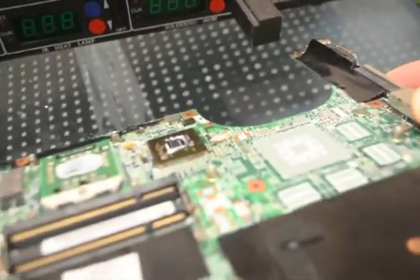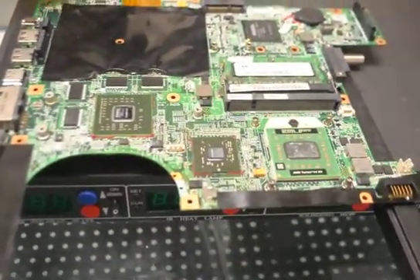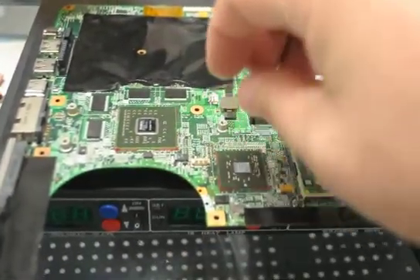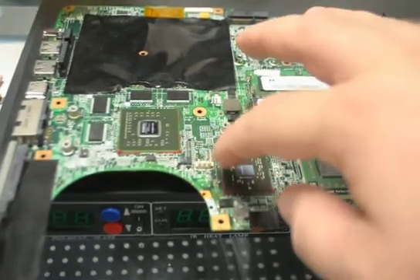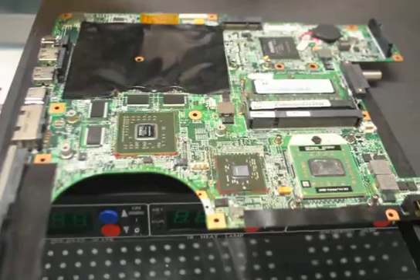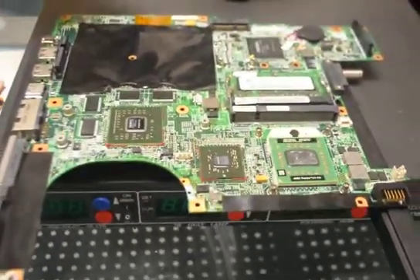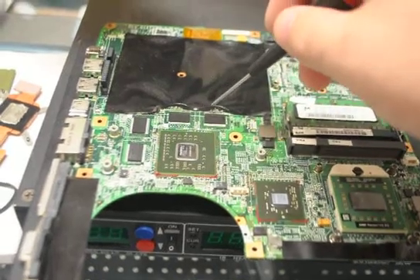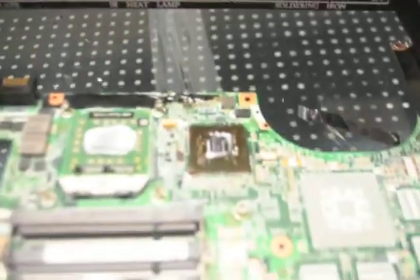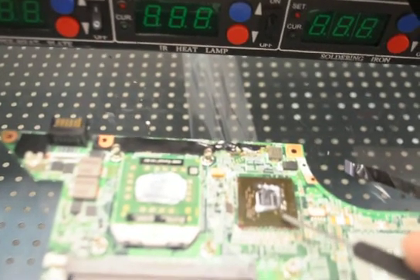There's actually damage to that jack. When the reflow process is done correctly, you'll notice this black plastic up here is not even touched. Your heat and concentration is done on the chipset, and this jack right here is undamaged — you have three individual parts clearly visible. On the damaged board, you cannot see them; you see a cutout where it's damaged. This damage is actually from a hot air gun — the discoloration and the actual separating of the chip.